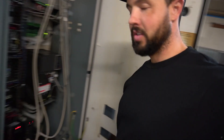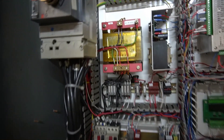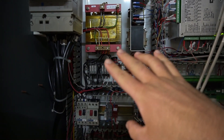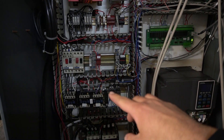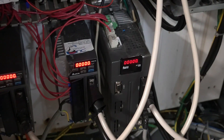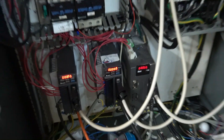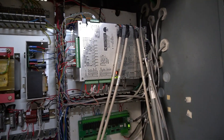We'll start in the cabinet — this is the biggest nightmare part of the whole retrofit. We have power coming in, it goes through a couple transformers, gets slimmed down to either 24 volts or 110. We have a couple fuses here, some contactors here, big contactors for the spindle and the coolant pump. And these are our drives — delta drives. These have to be configured individually one at a time, then calibrated. This big one here is the spindle drive.